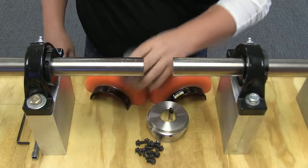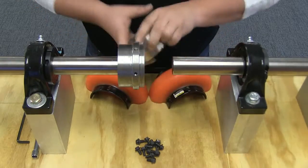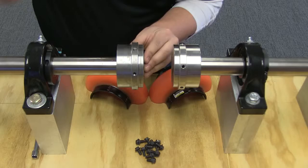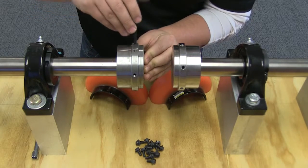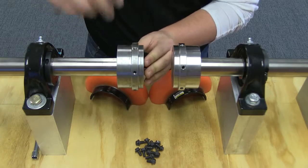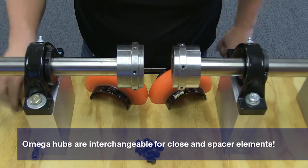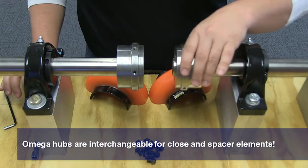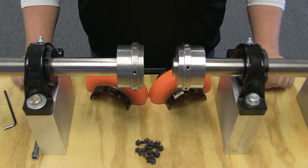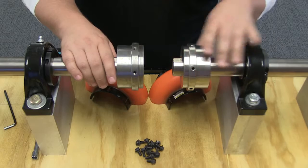Once your shafts and bores are clean, mount both of the hubs to the shafts, securing only one hub, leaving the other loose for minor adjustment of spacing. When using a tapered bushing, follow the bushing manufacturer's instructions. If the hub is bored for an interference fit, we recommend heating the hub in water, oil bath, or an oven, and quickly positioning the hub onto the shaft. Do not spot heat the hub, as that may cause distortion. For straight bored hubs, all published shaft gap requirements are with the hub face flush with the shaft end.